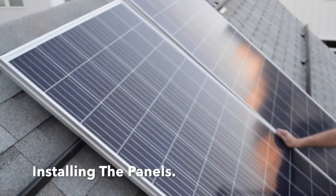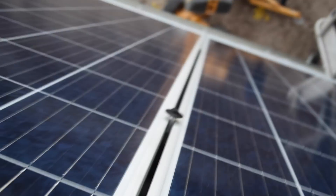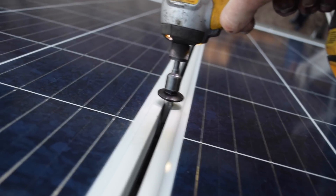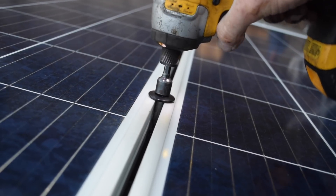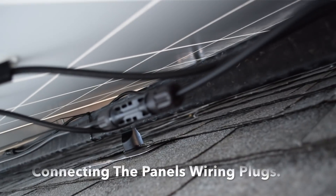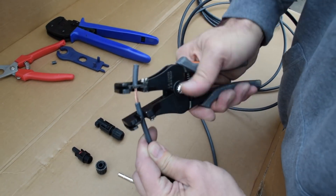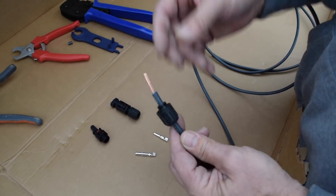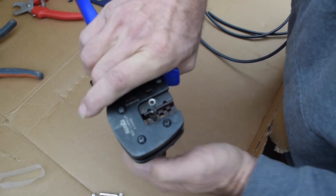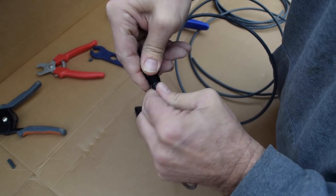With the rails in place, we were ready to install the panels. We started at one end and attached the panels using the bolts that came with our rail system. These bolts hold the panels in place and act as a grounding bond between the panels and the rail, so the panels don't need separate ground wires between each other. The panels come with pre-wired male and female connectors called MC4 connectors, providing an easy and watertight connection. For wires that needed to be extended to reach the shutdown box, we attached MC4 connectors to the wire ends and snapped them together. We used wire stripping and crimping tools to prepare the wire ends and crimp on the metal sleeves.